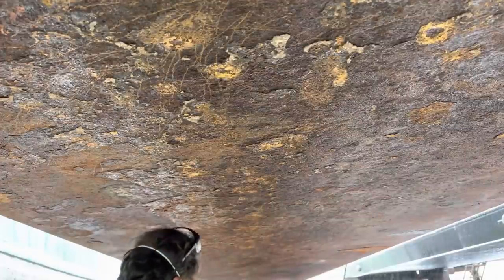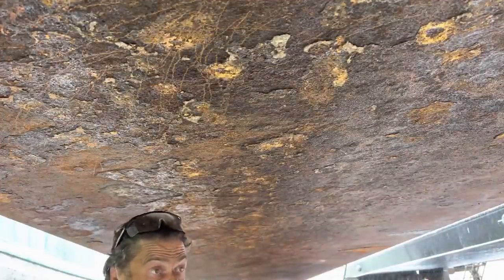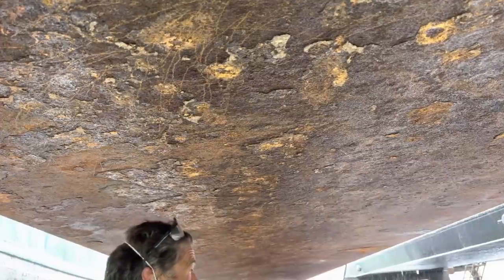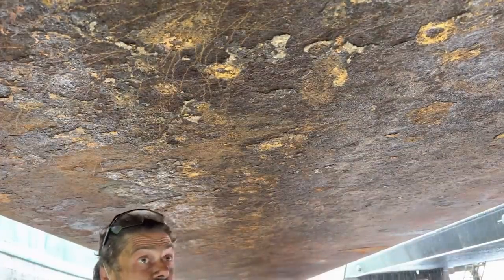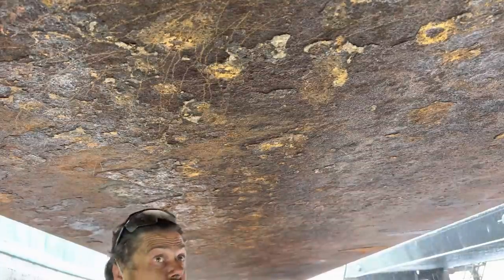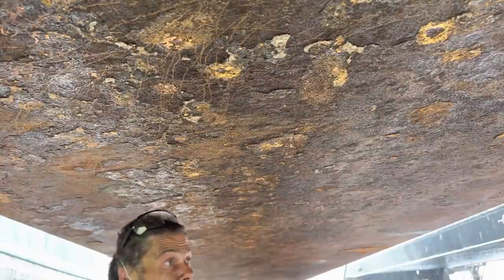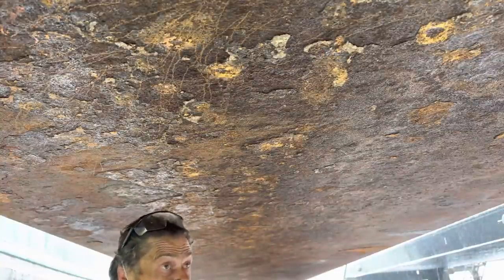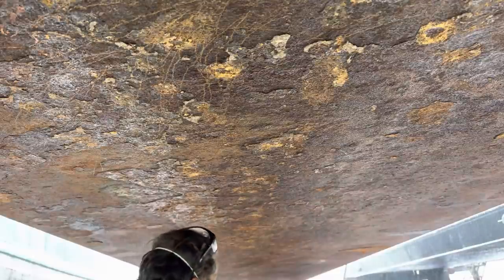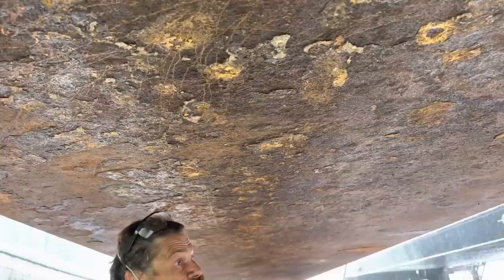And there are a few pits I've probably uncovered, maybe seven. They're really marginal. They're kind of half a mil, so they're kind of nothing at all. But still, it is giving me the opportunity to survey the entire base plate, which is quite good. I'm now thinking, though, after cleaning it all off, probably the thing to do is to vac tan it all before I black it. It's kind of ultra peace of mind.